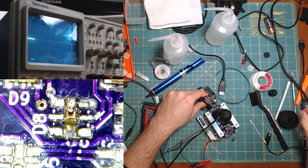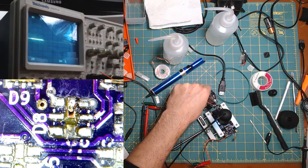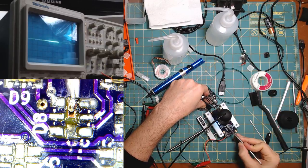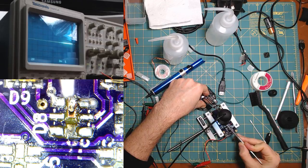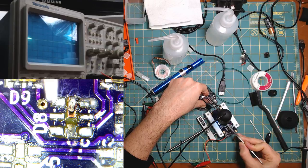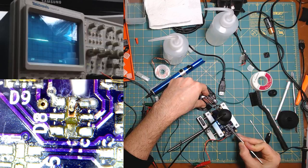So yeah, you can see those pads. Here's my tweezers. So the pad, I'm looking through the, yeah, this pad here. There are two pads in the middle, one connected to ground and the other to VCC, but there's also two pads on the side, like this one here and this one here, that are connected to ground and VCC. So my guess is that these two shorted, the middle one and this one, one's ground and one's VCC. And because the LED was maybe crooked or a little bit of flux, who knows, right?